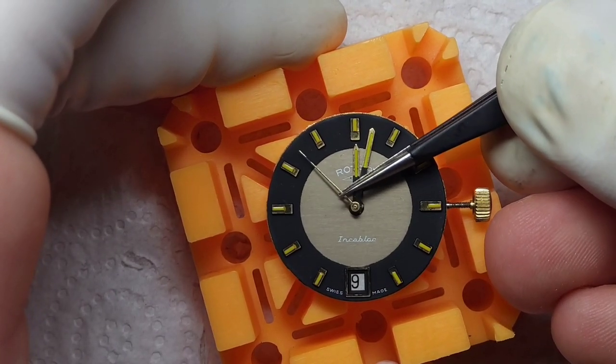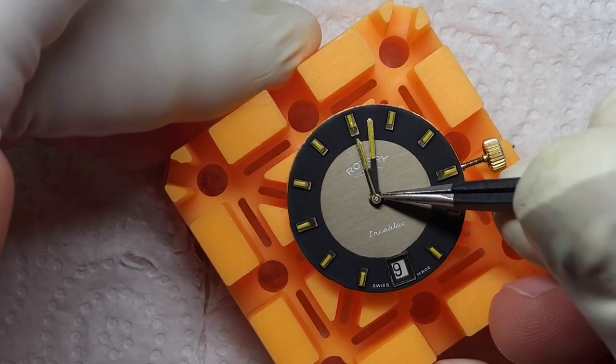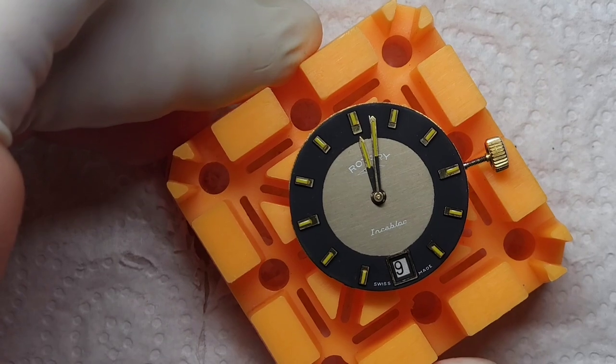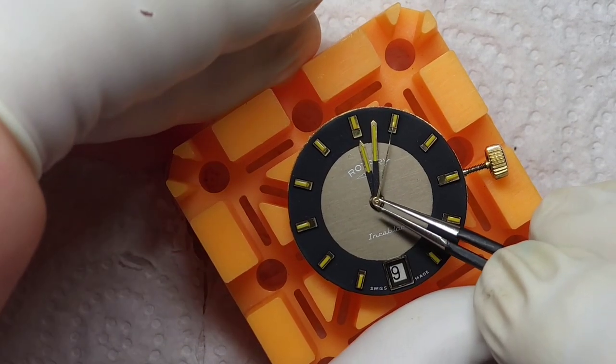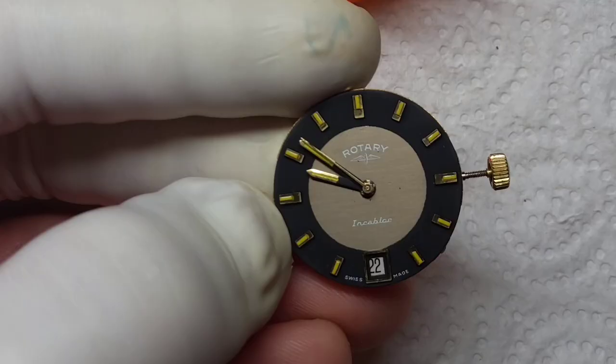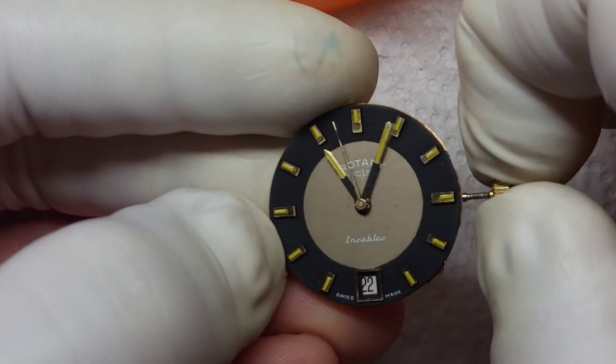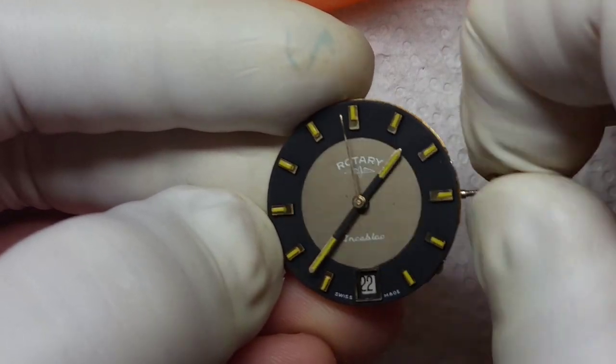This minute hand is arguably my least favourite to put on because the watch is running at this point. I could remove the force from that mainspring to stop it from spinning, but anyone else can do it so I'm going to do it as well. There was a jump cut just there because of the unfortunate necessity of my own foolishness — this is a date set watch, and what that means is at some point that date actually clicks over. So because of that there becomes a time when it jumps over from one day to the next.